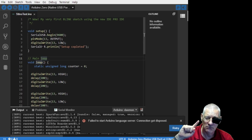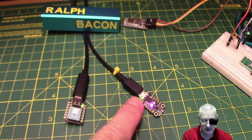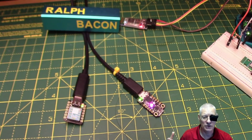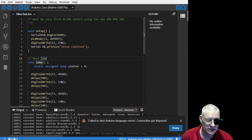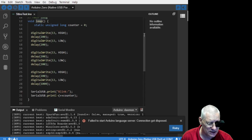Now on the Adafruit Trinket M0, they've done a little funny, that's a technical expression obviously, they've simply defined Serial as SerialUSB, because the only port they've got on that little device, that one there, is the programming port. Okay, it's not the native one, it's the programming one. So they've just done a define, so you can continue to use Serial.println in their particular case, but really we should be using SerialUSB and get used to that idea, because we're not using the native USB port. But apart from that, as you can see, it just does a flashy 3 times and does this little print thing here.